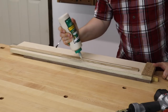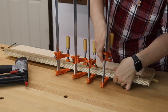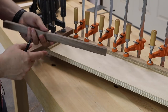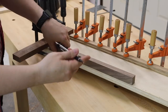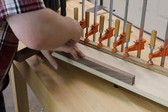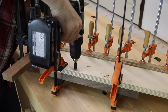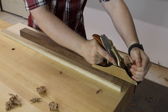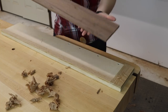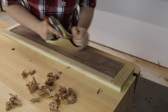Come back and clean up the squeeze out. Then I put glue on my one-inch wide piece, butt it up, shoot some brads into it, and use the off-cut as a clamping caul. While that dries, I work on the piece I'm going to use with the cleat. The length really doesn't matter — it could be twelve inches or the length of your vise. I lightly mark a rough width in pencil, mark my center line, place screws along the length, drill and countersink my holes, and drive the screws in. Once it's dry, you can open your vise, slide it in, and if you need to work something that's a little bit on the thin side — with this at a quarter inch at the front — you can come right in and work that material.